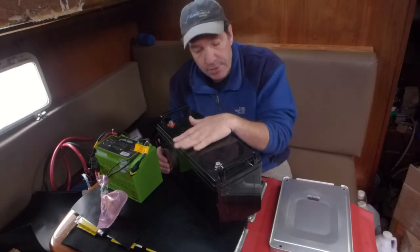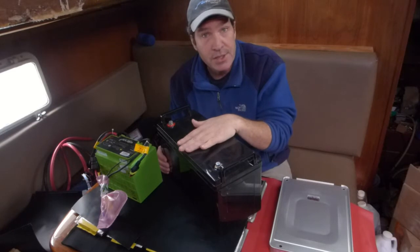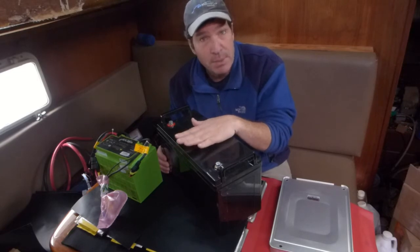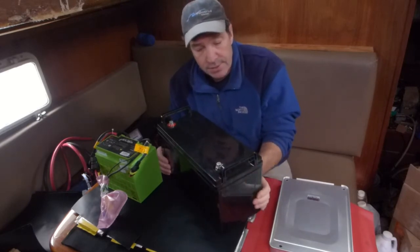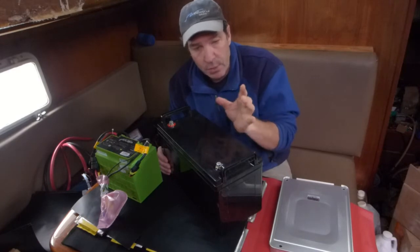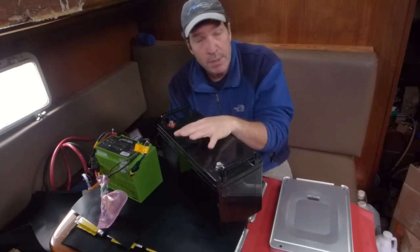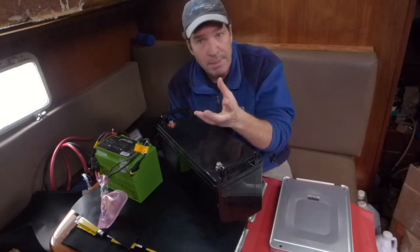This is rated fairly low. The maximum charging capacity is 40 amps. The continuous discharge rate is recommended at 40 amps, but it can do 80-amp discharge rate — though it's not recommended, and I think that's probably the limit of the BMS. Because it was so light, I did an output test on it just to make sure it was indeed 100 amp hours, and it did go over 100 amp hours. I did a really slow amp discharge, on the order of about 4 or 5 amps, so it took a long time — probably close to a full day — getting to about 110 amp hours before it shut off.